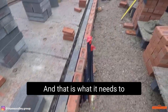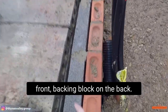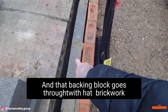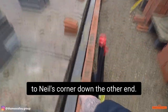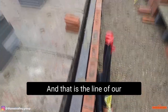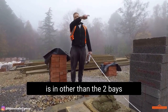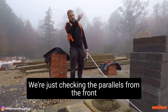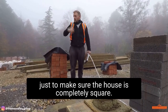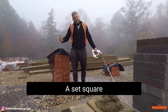That is what it needs to look like all the way around — you've got the brick lock on the front, backing block on the back, and that backing block goes through with that brickwork into the corner down the other end. That is the line of our house all the way to the top. Both the sides are in, the front's in — other than the two bays which I'm going to set out last. We've strung a line from corner to corner and we're just checking the parallels from the front bays to make sure the house is completely square. It's all been set out on a set square but I want to double check.